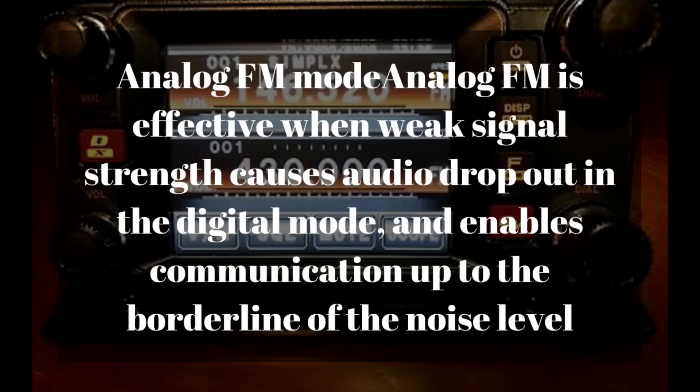Last but not least is the analog FM mode. This mode is great for when you're trying to make contact that's a little too far away on simplex to hear well — digital is either going to be there or it's not. But with analog you have a little more room. In digital mode you might have a seven-mile reach on simplex; on analog you might get an extra mile or two. This also works great if you're on the fringes of a repeater — you can use analog mode and you'll be able to hit the repeater a little better.